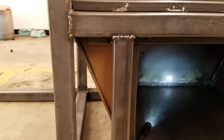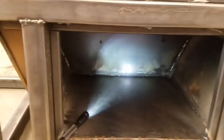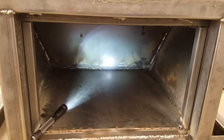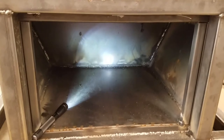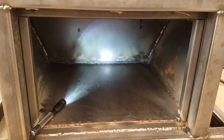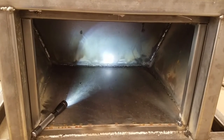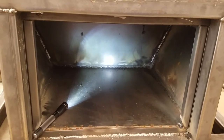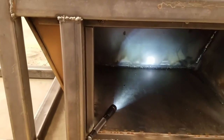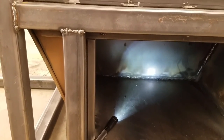We used those cutoff pieces for the front pieces that go from the side panel to the door flange. We used the stick welder on it because it's quarter-inch thick. We've got a little cheap MIG welder right now — we may be upgrading to a Miller 252 in the future, but right now we're rolling with what we've got. So we've got MIG welds on a lot of the tubing and stick welds on the quarter-inch.